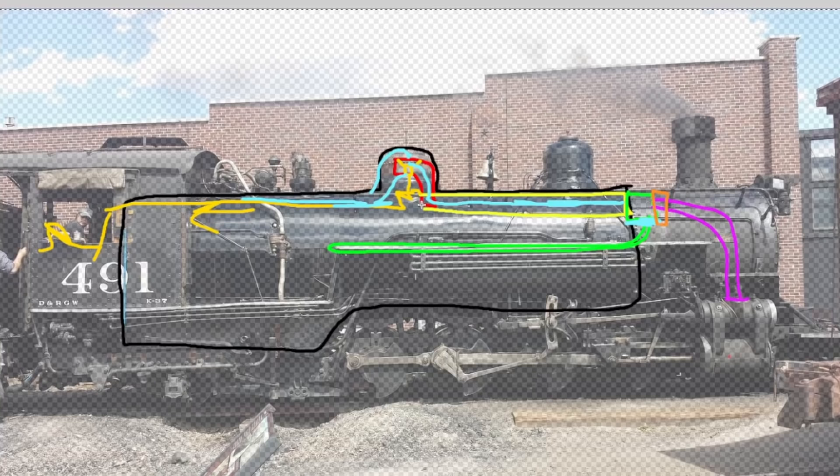The benefit of a front-end throttle is that you can take your steam through a pickup point at the driest location — the steam dome — run it through the superheaters pre-superheated, then feed it through the throttle, cutting out all the piping in your control for pretty much instantaneous response. On engines like 491 and the other narrow-gauge K-class, you make an adjustment at the throttle and have to wait for the steam to do the thing before it gets there, so you have to be a little ahead of the curve — which is what makes running those engines interesting.